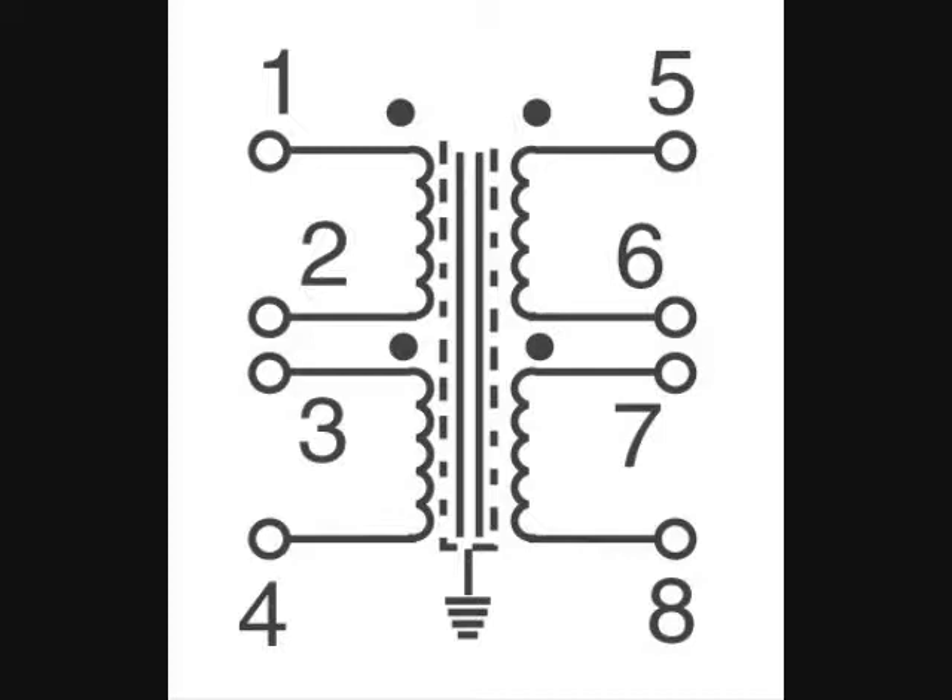Basically what we're going to do is connect audio to tap point five and six for the earplug on the radio, and the microphone to seven and eight. Then we go to the other side of the transformer and connect one of our two wires to tap one, the other to tap four, and put a little jump across taps two and three. Basically what this did was make an impedance matching transformer, so all these are now coupled together on the transformer.